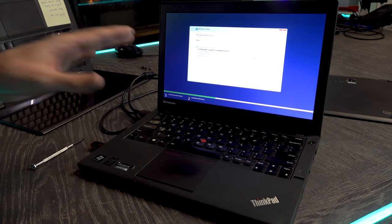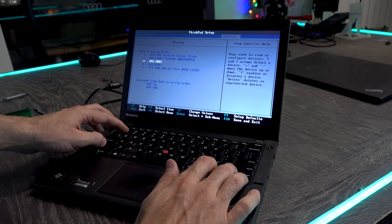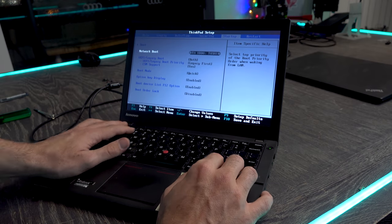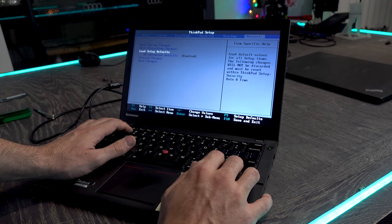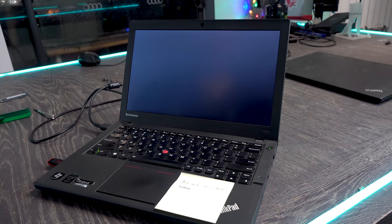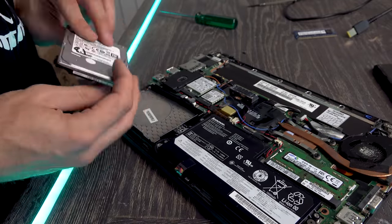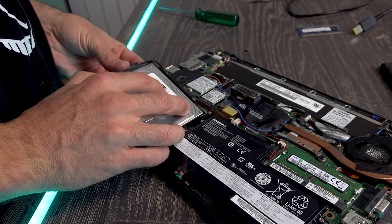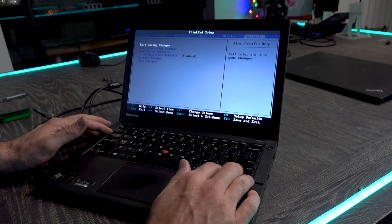So we're now checking out the first laptop of the two, and this one looks absolutely fine. It did have a message on there, boot problems. So we went into the BIOS, and if you get into the BIOS, that's usually like 99% of the problem solved. And then I saw there was only 2 gigabytes of RAM. So we installed a 4 gigabyte stick, took the 2 gigabyte stick out, because if you want to install Windows, especially x64 Windows 10, you need 4 gigabytes of memory. That's a prerequisite. So we put that in, we set the BIOS clock to the current date, and then we reset the system, and it seems to be fine.